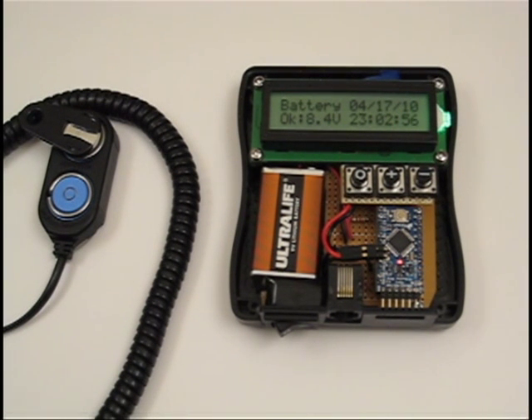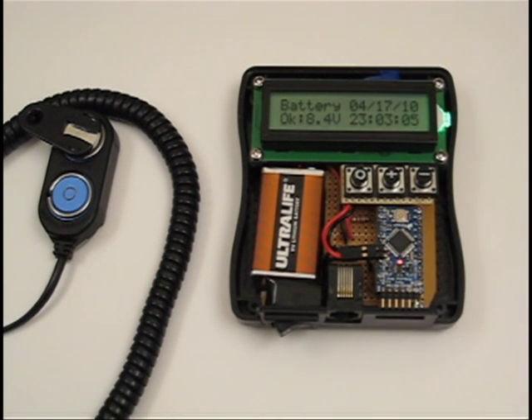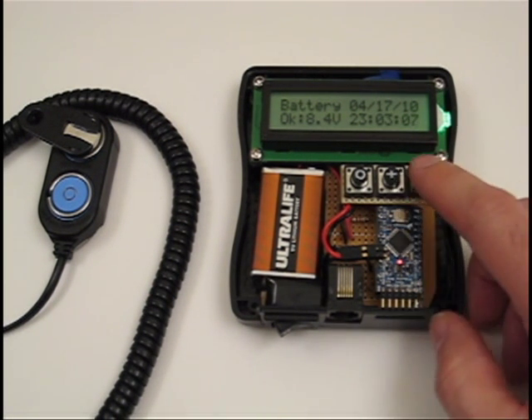This makes it practical to use a lithium 9-volt battery to get 40-plus hours of run time. I switched from hardware interrupts back to software debounce with revised polling to allow the sensors to update and still make the buttons responsive.